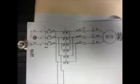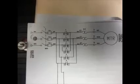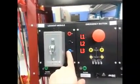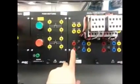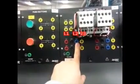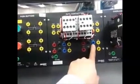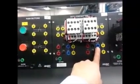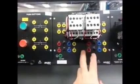The first part of the lab you should hook up the high voltage side, which means L1 all the way to the T1 connections. So you will start here with your L1, 2 and 3 and run power from these red, black and blue to your red, black and blue on one contactor and red, black and blue on the other contactor. Now as mentioned in class, to reverse the direction of a three phase motor, you need to reverse two of your phases.